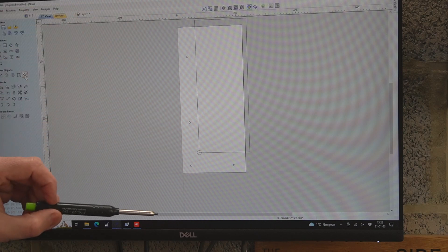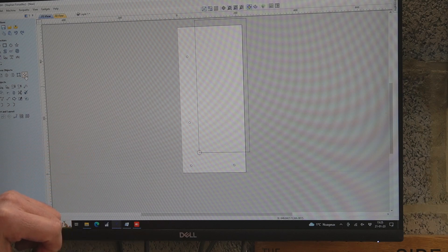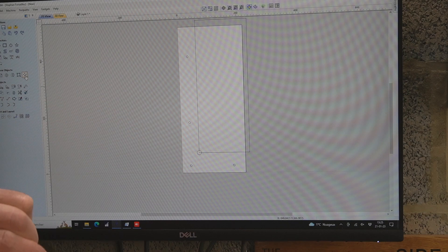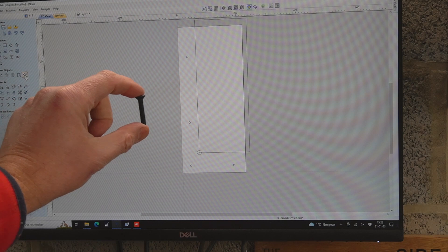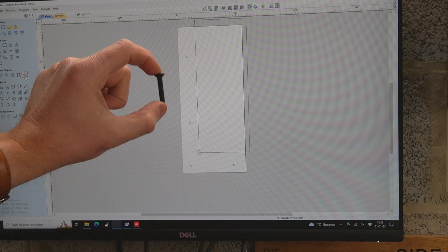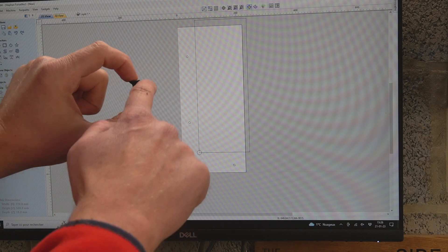This is the overall design of the jig. We will start by drilling those four holes that will hold the jig in place on the wasteboard. For those we will use a zero point here at the lower left corner of the jig. Not very important to be precise now — it will be important when we reference the zero point that's going to be the zero point of the jig itself when we use it later. I will use these 6mm screws. As you can see, they have a tapered head. I don't use flat head screws — when they screw into the board, they automatically put the center of the hole exactly at the center of the screw because of the taper.